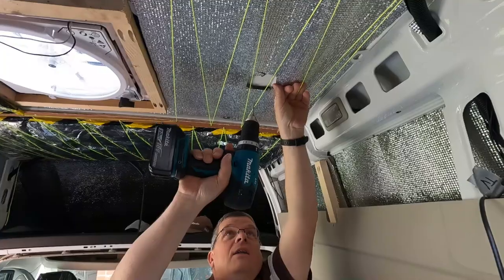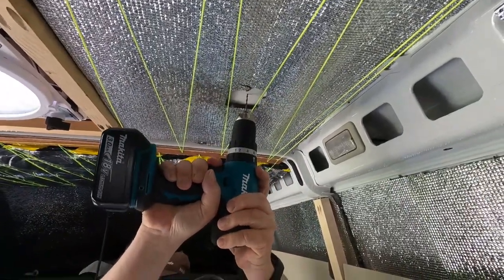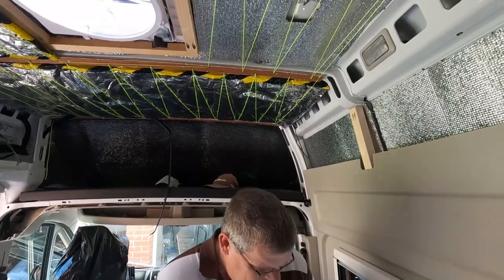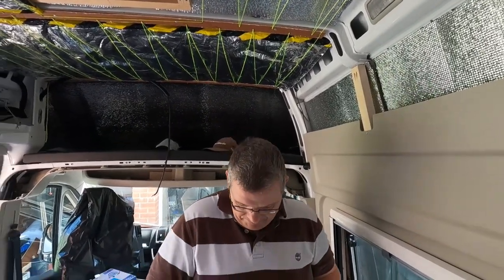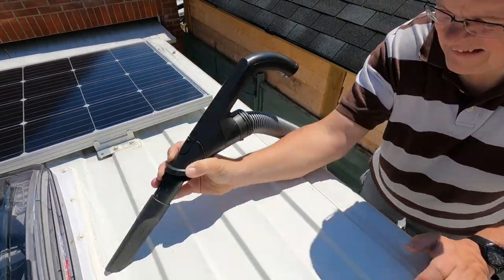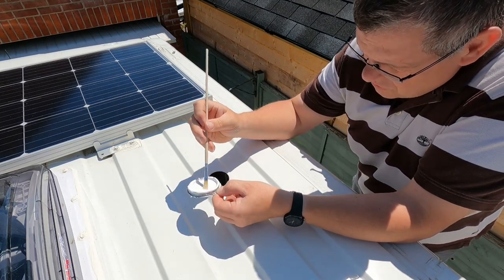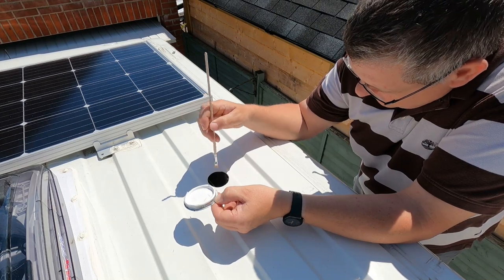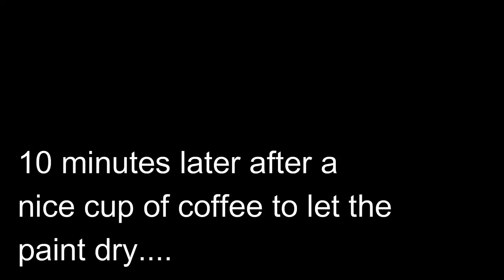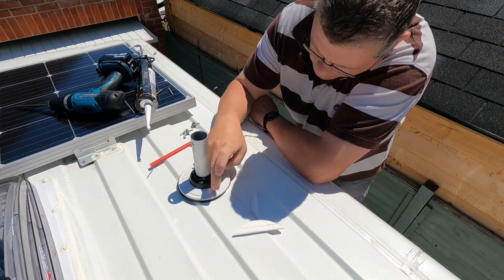Here's the upper part of my ribs - I'm going to try and get this plumb in the middle. We have daylight - right, let's go up on the top with the hole saw and cut that out. Now I've got my hole and cleaned up all the swarf, let's just treat the edge with some Hammerite.